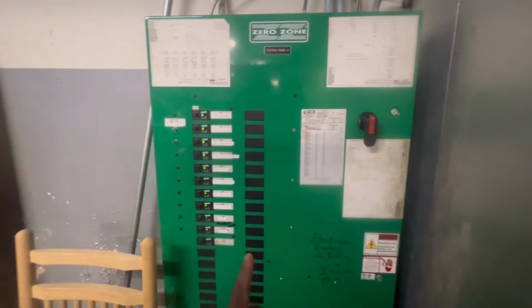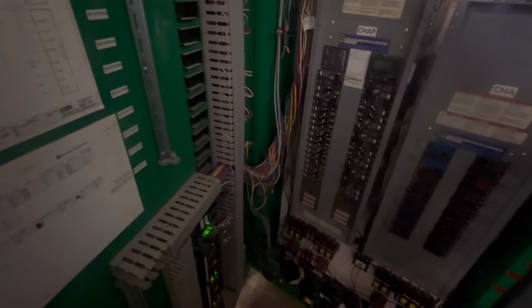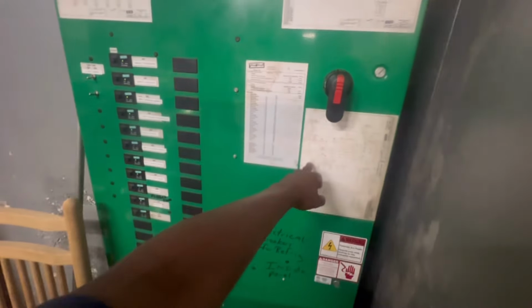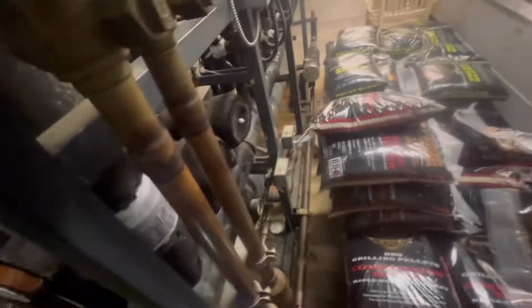Last time I was at this store, the rack was down due to a blown fuse in a panel over there. These boards right here, the Danfoss boards, was off, so it wasn't sending any type of command or nothing. So I had to change that fuse to get a proper voltage to these bad boys here. Anyway, I thought this was the receiver, but it's not. It's 0%, but it's not even hooked up to nothing. As you can see, it's taped off. It ain't hooked up to nothing at all.